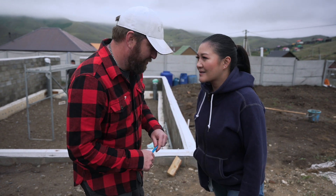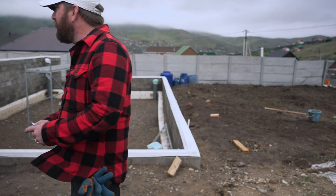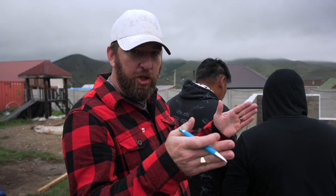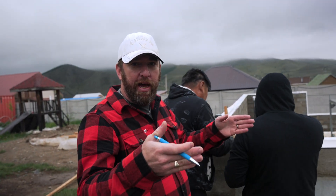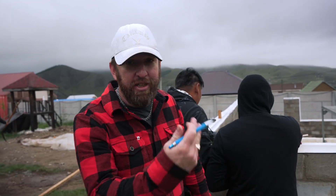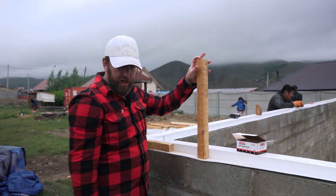Work work work - you know those funny videos with the wind. Let us show you something. The problem we had was there was a bit of a difference in the front of the wall to the back of the wall. So we're just going to add extra wood on the back so that both sides are level when we go up with all the rafters. We came up with the solution and this is the way we have to do it. Then of course we're going to be going up following the roof because we're going to be covering this side up with insulation as well.